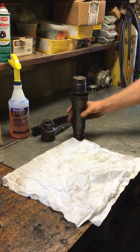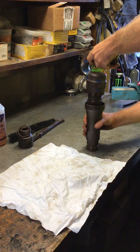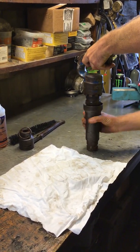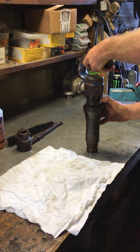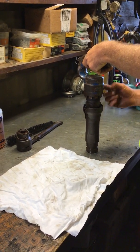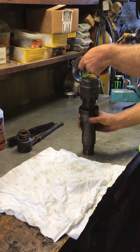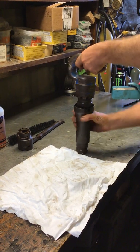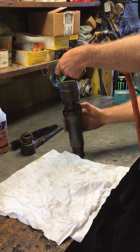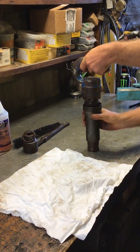It's all cleaned up and oiled. Take your handle and thread it back on. If you have trouble threading it on, clean the threads — never force it. If it's tight the whole way down, you've probably cross-threaded it, so just be careful with that. This should easily thread all the way down until it seats up onto the barrel and makes a proper seal.